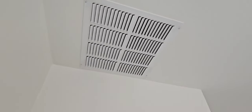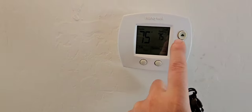In the primary bedroom you've got a duct with no filter, and right here you've got another duct with no filter. That's a jumper duct that equalizes pressure from here to here if the door is closed — so if you're sleeping and the heat turns on, the door doesn't slam shut. AC was working great today.